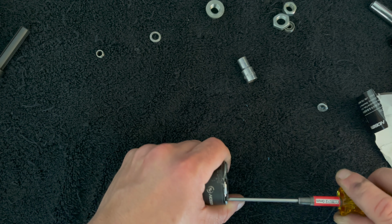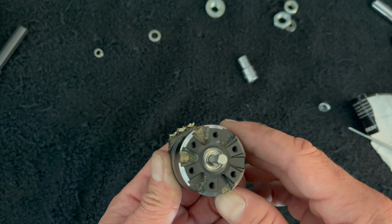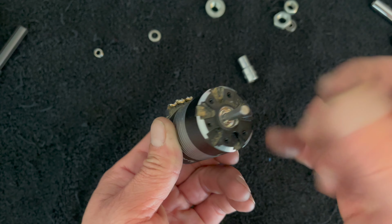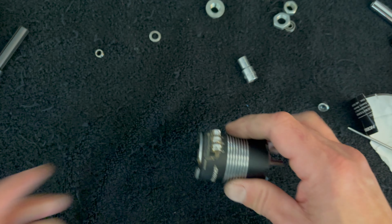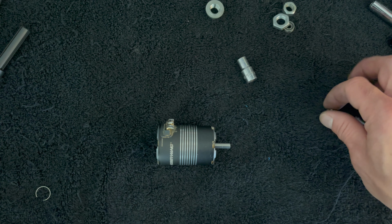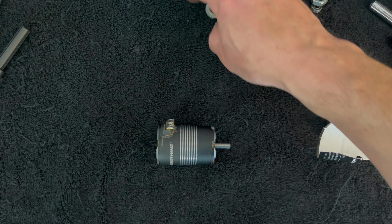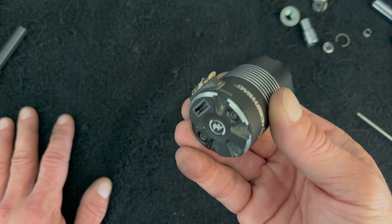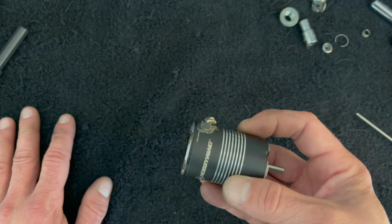And like I said, this is not pretty, right? But that bearing's not gonna go anywhere. I just opened up the space before the race so I could bust out that broken race. And obviously, there's a bunch of people online, I'm sure, that know how to do this better than I do with a press or a bearing removal tool or anything like that. But this is a nice, simple way to look at how you could fix this in the garage versus having to send it in to get replaced.